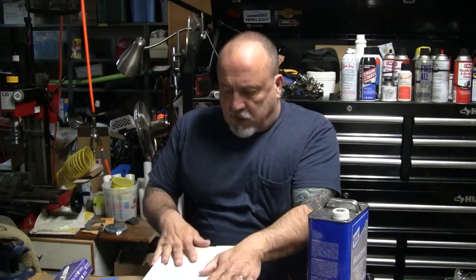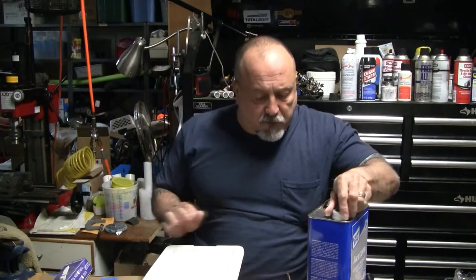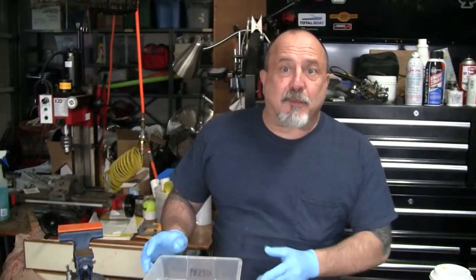We're going to let these soak for at least an hour — I at times let them soak overnight. I'm going to cover this up to get as little evaporation of the acetone as possible. I'm going to recover this acetone, put it in a container, and use it to clean everything up afterwards. Most of this acetone will go towards cleaning the airbrush after the Cerakote is done.